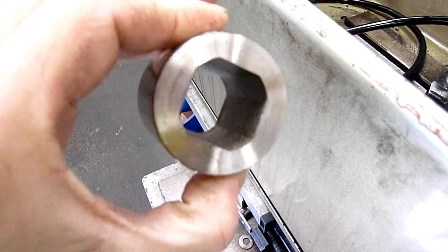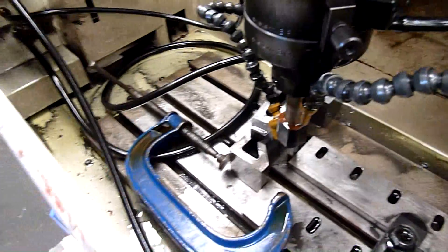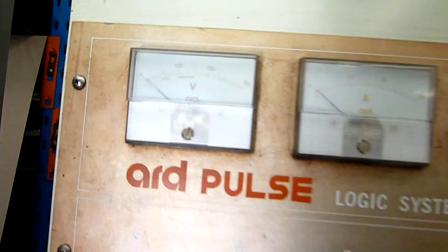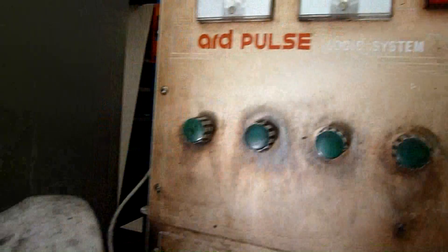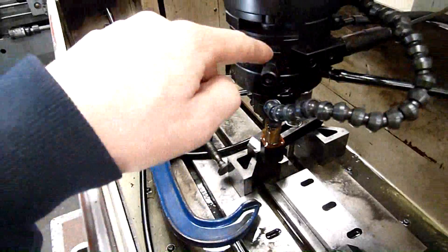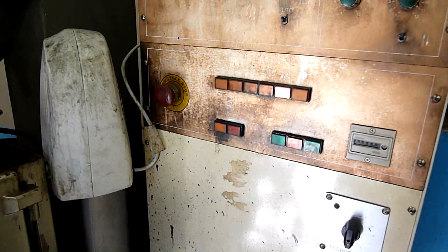It allows you to burn custom profiles in things. This is a die sinker EDM, so all it does is sink the die gradually into the material using low voltage DC discharge — up to about 100 volts at 10 to 20 amps normal running current. Technically that is low voltage, not high voltage, but you still don't want to touch it, or at least touch ground and then the head while it's running. It gets a bit unpleasant.